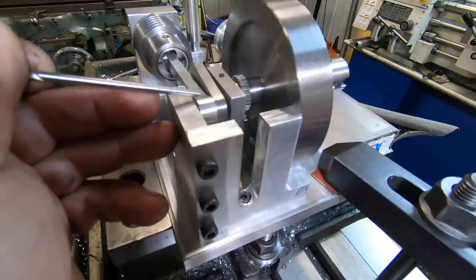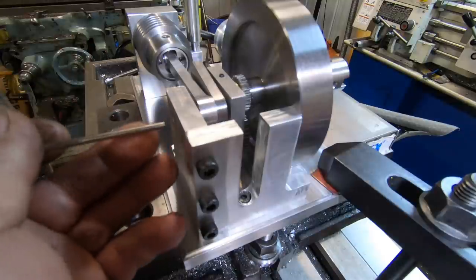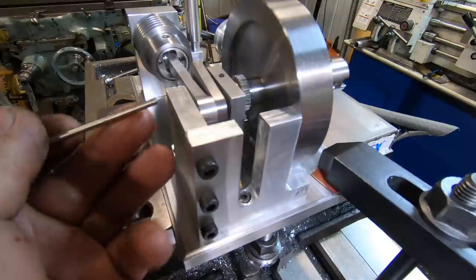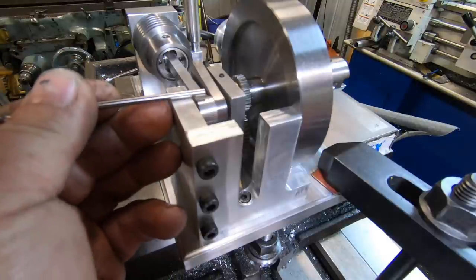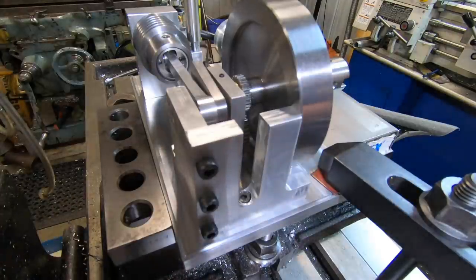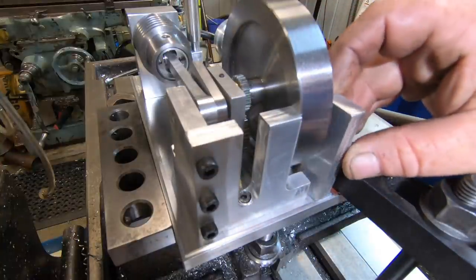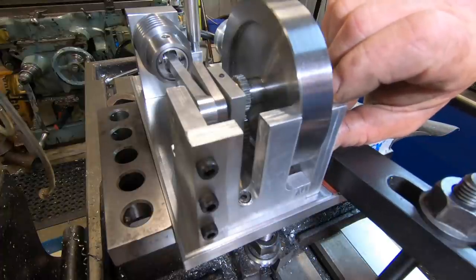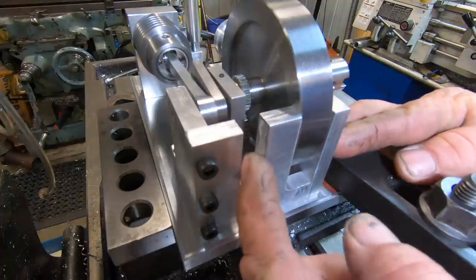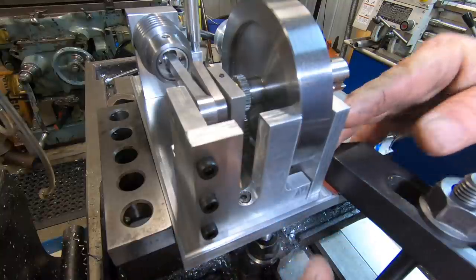So what it does is I've made up a pin that screws into the grease cap hole on the crankshaft that greases the big end. And that slides into a hole here, which it's all done off measurements when you build the frame, which holds a crankshaft at 15 degrees before bottom dead center. And then what you can do is time the flywheel or the cam, the exhaust cam, put this one in here and use an engineer's clamp, and just clamp the flywheel, and it can't move. So it's pretty much a foolproof system.